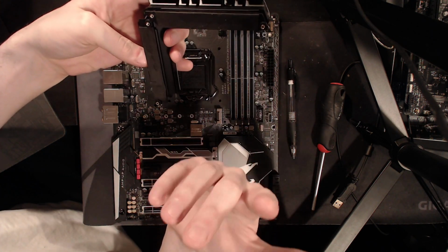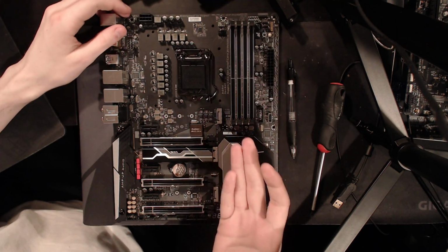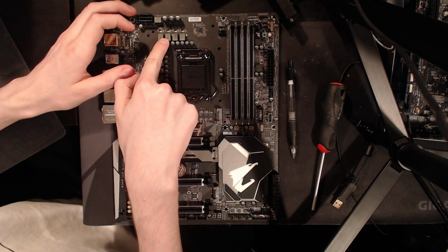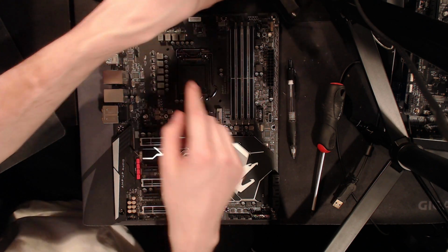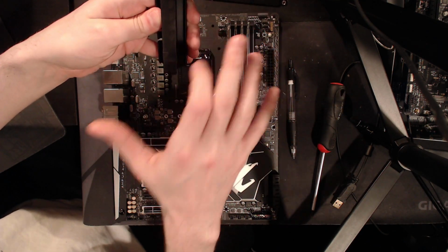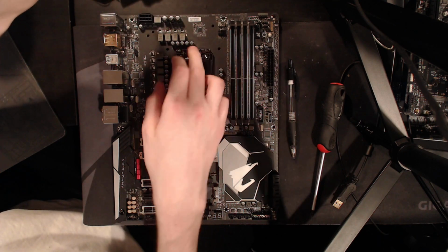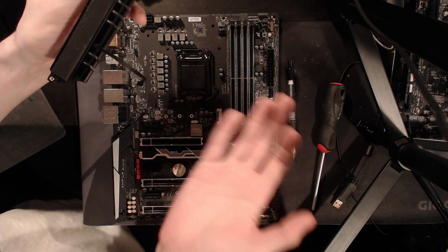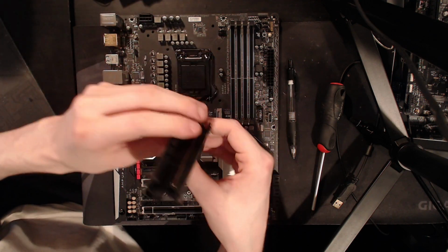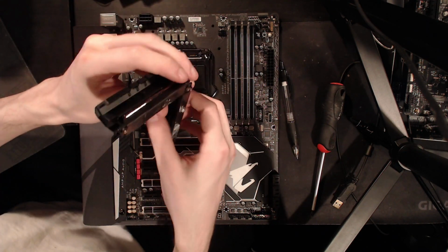There's a heat pipe in here, and basically the only thing the heat pipe is doing is sharing heat, because the way this VRM is set up is an 8-phase, we'll get to that. Basically, you have these 6 phases down here, those are vCore, and then you have 2 more phases for iGPU. So it's an 8+2. The 6 phases of vCore will be the ones running hottest, because they're all next to each other. So it'll share heat up into the upper heatsink section. The iGPU phases basically won't be running if you're not using the iGPU, so those 2 phases literally don't do anything and won't be producing heat in a lot of scenarios. So it's actually really useful that the 6 phases that do a lot of work get to use the iGPU's heatsink.